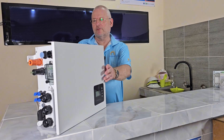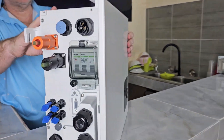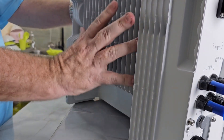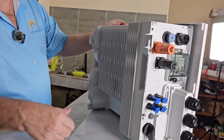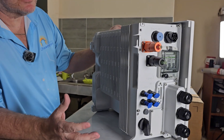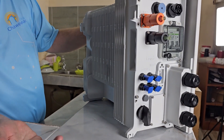If we take a look at this inverter, we have a huge heatsink in the back. It's a very big integrated heatsink that is sort of standard now on all inverters, but it still has to be designed properly — and certainly this is. This inverter is IP65, which means that it's waterproof to a certain level — not submerged, but waterproof to splashing and things like that, thanks to these kinds of connectors.